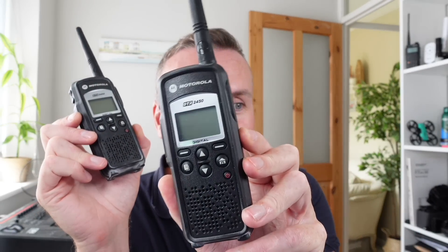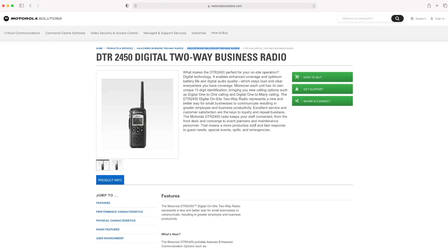In particular there's a new Icom that's surfaced which does microwave stuff, which got me thinking — I've actually got some microwave stuff. Technically this is 2.4 gigahertz radios which I never actually got around to testing before: the Motorola DTR 2450. These radios are actually discontinued now but if you head over to the Motorola Solutions website you can get some info on them. They're listed as a digital two-way business radio under the unlicensed business two-way radio section, which isn't surprising because they operate on 2.4 GHz in the ISM band — an open band used for Wi-Fi that doesn't require a license.